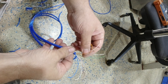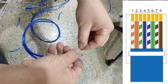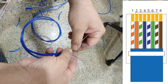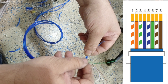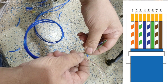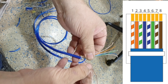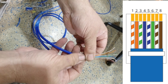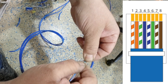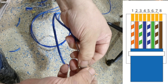My first pair is going to be orange and white, then orange, then green and white. I'm starting to straighten them all together as best I can. Then we've got solid blue — bringing that in. After solid blue I've got blue and white, bringing that in. Beneath my fingers right here is where I've got it 100% correct and I'm holding that nice and tight. Then brown and white and then brown. I'm basically just straightening them as much as I can with my fingers — I find it works easier like this.